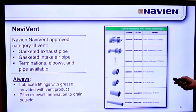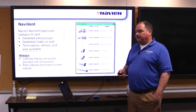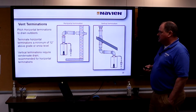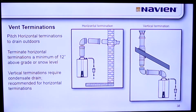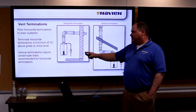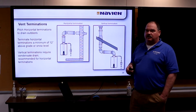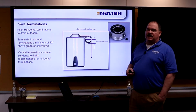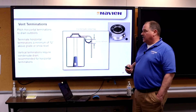There are different accessories for venting: different terminations, 90 degrees, 45s, roof terminations, and more. We can also vent them out the roof using that vent termination, and anytime you have a vertical run you definitely want to hook up the drain. You can get a little canister water trap — most people just zip tie on a little pigtail in the pipe. Put water in that pipe, because if you don't, you'll be blowing exhaust out wherever that water heater is located.